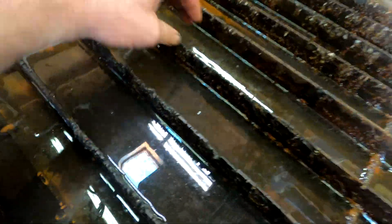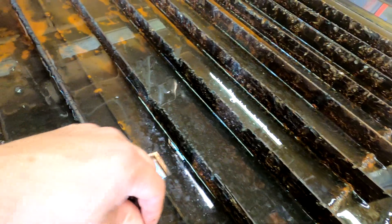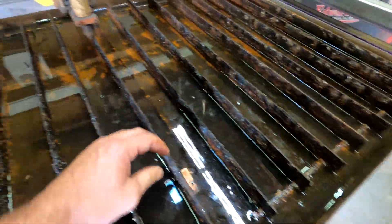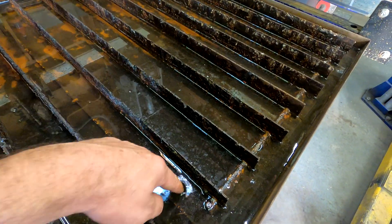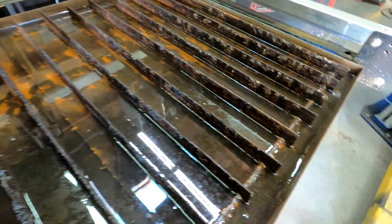As you can see, a lot of these slats are really starting to deteriorate. This is pretty inexpensive mild steel — I think it's an eighth inch, maybe two inches wide and about three feet long. But I live a couple hours away from the closest place to get this. So what I'm going to do is pull all these slats out and just flip them over, use the flap wheel to clean up the ends a little bit, and we'll get some more life out of them that way.